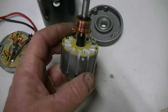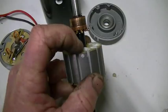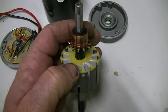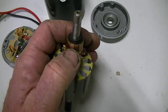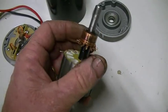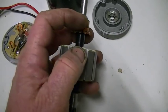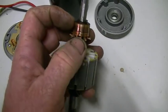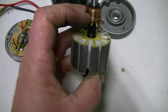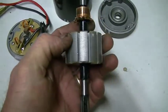The current won't flow back as the coils become open — that's when the brush leaves the segment connected to the coils, causing lots of sparking at the brushes because the flyback is arcing between the commutator segment and the brush. Most of the flyback energy is dissipated as heat, sparks, and bits of brush getting blown away. The current simply cannot flow back to the battery because the brush has left the segment the coils are hooked onto — so it's definitely not the flyback.